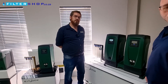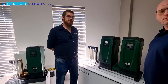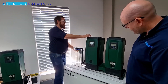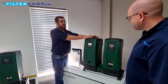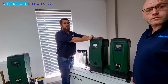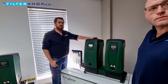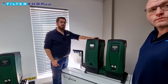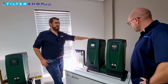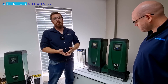One of the things about these pumps is there's a non-return valve mechanism at the back — the material says you need to switch it depending on whether you're drawing from vacuum or not. It essentially helps with priming and keeps the line primed when you are lifting, which is why you need to change the spring. It's basically a non-return valve before the pump to prevent water draining out. If you're not drawing from an underground source you need to change it over — essentially to avoid adding extra losses to your system.